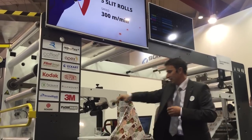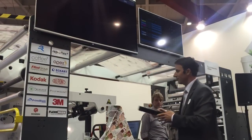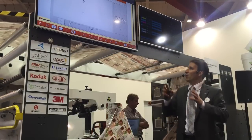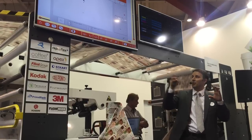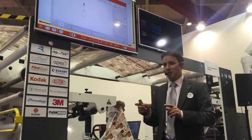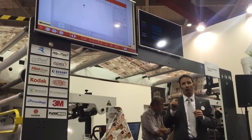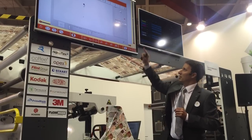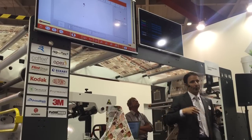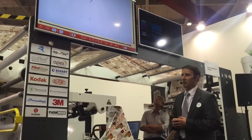The next step is register setting. Lukas is printing just enough material to locate the micro dots. We take a snapshot of the micro dot positions, see the job is out of register, and stop the press — no more waste. Since this is a gearless, automated press, we tell the press where each micro dot is. Lukas chooses printing unit number four, which is violet, and locates the crosshair in the middle of the micro dot, repeating the procedure for all six printing decks using PST's smart register system.